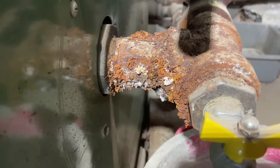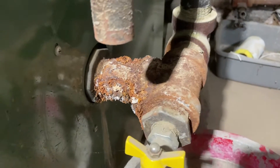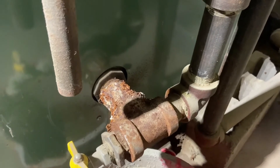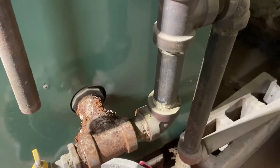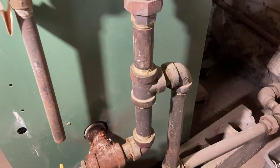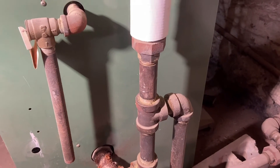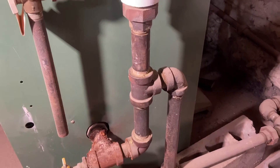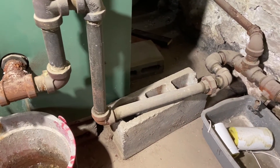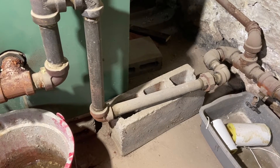As you can see, this nipple is pretty compromised — under pressure it actually started to leak into the bucket. I don't know exactly why it got so corroded out. I would imagine he wasn't draining water out of the boiler like he should have, which could have contributed to it rusting out like that. There's probably a lot of accumulation inside that nipple.